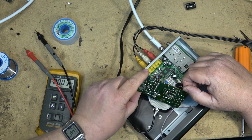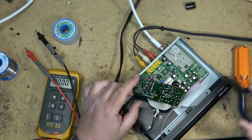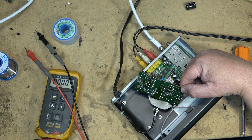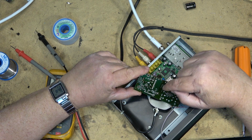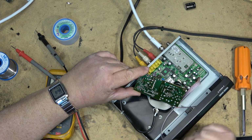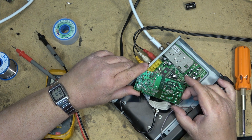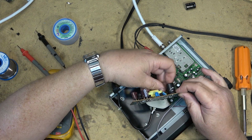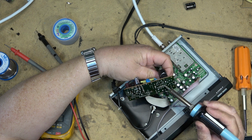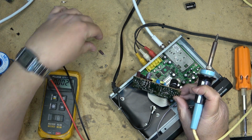So I'm just looking to see where it goes. So we have our high voltage. I'm just going to discharge that cap, whatever remains in it. So what happens on this is the high voltage DC is going through the transformer, then it comes up and ends up on I guess the drain for the drive. The oscillator is set up over here with the other capacitor, and it should start self-oscillating as soon as it's got power. Now, say the other little cap over here can certainly cause things to not work. We'll just pop this cap out and check it and replace it and see whether we get anything different that's happening. So there's that cap out, because this is the startup cap. This can certainly cause it to not start.